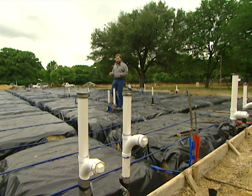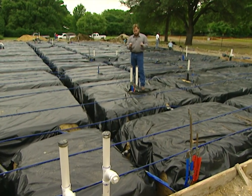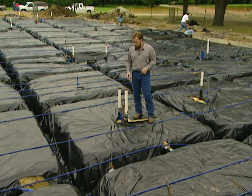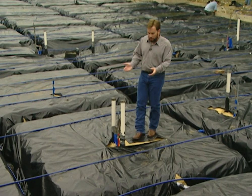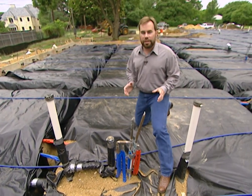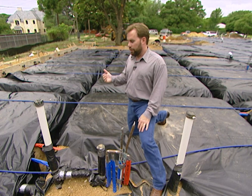Here in our kitchen we have a great example of planning ahead. This is going to be an island with a sink in it — we've got to put our pipes in right now. You don't want to jackhammer that concrete up later. You're going to end up getting into your post-tension cables or into your rebar if that's the way you poured your foundation. It's going to be hard to make it drain. You've got to plan ahead. This little area right here actually takes care of two bathrooms upstairs plus a shower and a steam shower here in our cabana room.